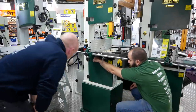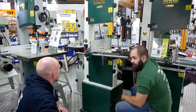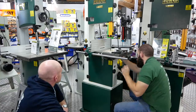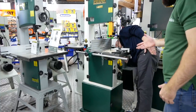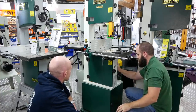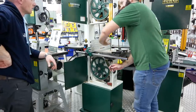Underneath on the Sabre 350, it is currently set to zero — so your table is horizontal and flat. If you wanted to, you can move this bar out of the way and go to a negative angle. So if you needed to do any negative cuts and the shape of the wood wasn't conducive to doing it on the other side, it's a feature they've included. There is then a cam lock to lock that all in place so that if someone leans on the table, it doesn't knock it out of angle — that's the other bar underneath. It's important that bar is in normally because that stops the table from moving. If you put a heavier bit of timber on here, you're not knocking the table out of alignment.